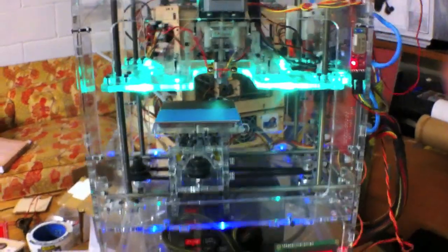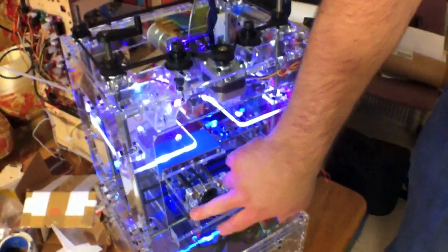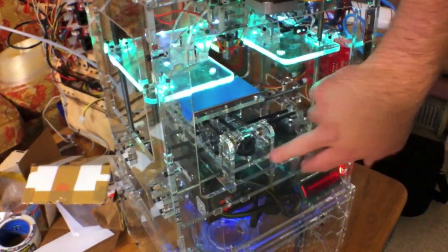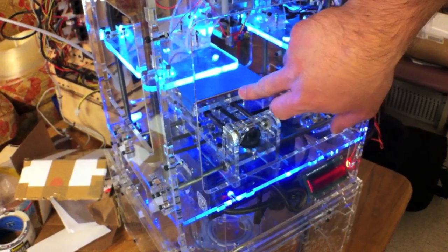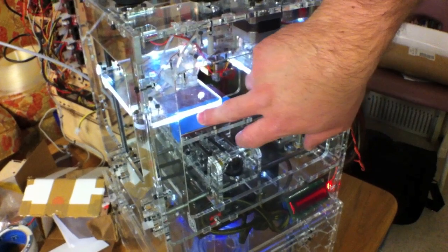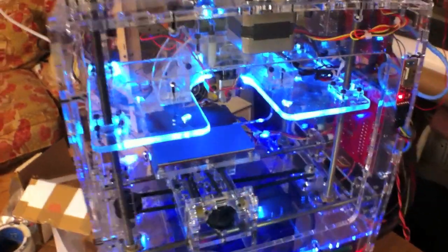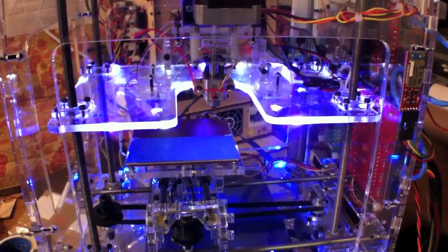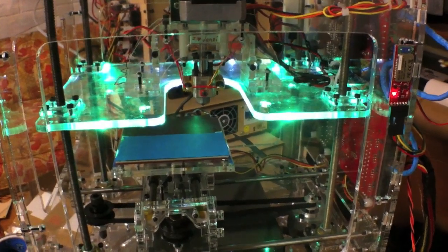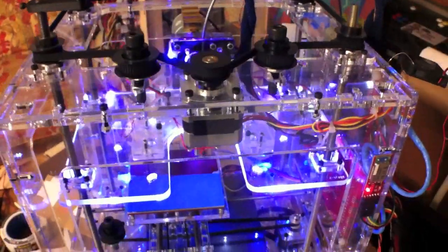The chip I'm using has room for 16 strings. I'm going to put another red, green, and blue — or would that be white — on the build platform so that it will actually glow to tell you the build platform temperature. Right now it's going through a rainbow demo sequence, but when I get the code all merged in, this will show your extruder temperature: starting out at blue, working its way up through yellow and orange to red — meaning a temperature where you can actually get burnt — and then slowly working its way up to white with the help of the white LEDs when you're at set temperature.